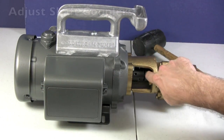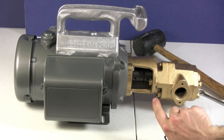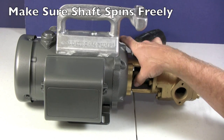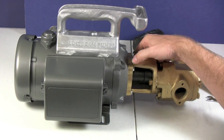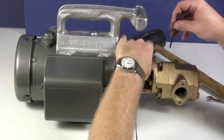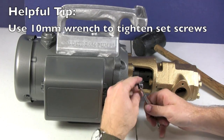With everything in place, you can adjust any of the play and I found it helpful to use one of these to move the coupler around. You don't want it snug right against, but you want it tight enough that you don't see a whole lot of daylight through there. Rotate the shaft to make sure nothing is binding, then tighten everything up. These bolts take a 3mm wrench for the set screw. Here's a trick: if you grab the end of a wrench, you can get a hold of it and use that to tighten those up.